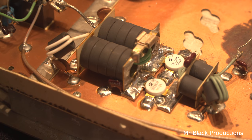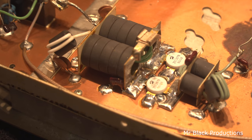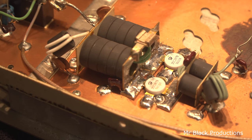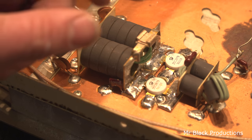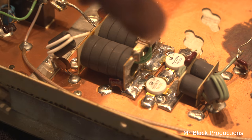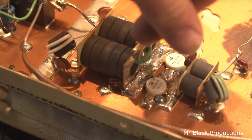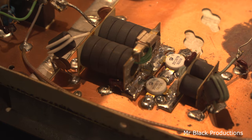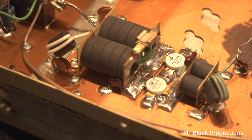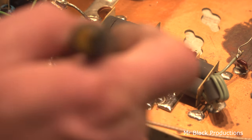You need to keep this in mind, bro, that this heat sink either needs to be replaced or it needs to be pulled out, welded, and then the transistor reinserted, or welded, drilled, and tapped. I went out and got the same size screw, but they're real long and have a really aggressive thread, and it was able to grab into the edge of the heatsink wall and pull the transistor down tight. But that's usually a one-way trip. I'd only trust that maybe one time. And then after that we have to pull the heatsink out.